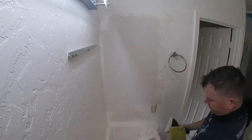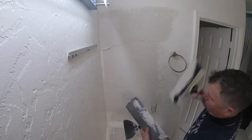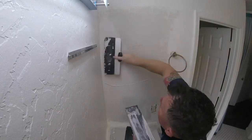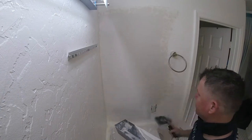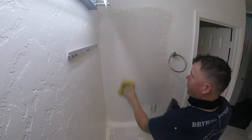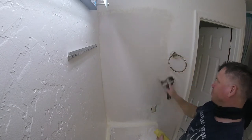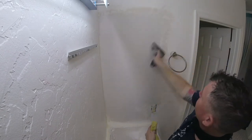Once you get it all ready, then you do a second coat. I'm using a hot mud here, so I'm just doing a second coat past my first coat — a tight skim coat. If you're not using quick set muds, it's the same process with joint compound: you want to take it past your first coat mud. After this mud starts setting up or dries, you want to slick it out again with a six-inch knife, going the opposite direction you coated it, crossing it off to fill in any chatters and grooves. Take off the extra mud — you don't want to build a big hump on the wall.